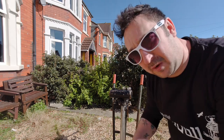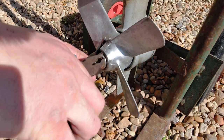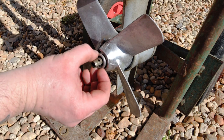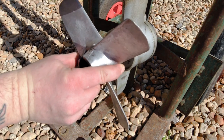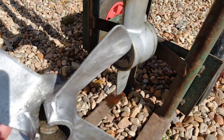I'll move the camera further down so you can see. It's really simple — literally get some pliers, squeeze the split pin, push it through, take the washer off, and then you've got the Seagull prop spring and then your prop, so just pull it off. It also gives you a good chance to check your prop and make sure there are no dinks in it.